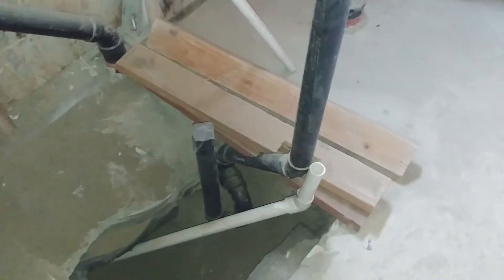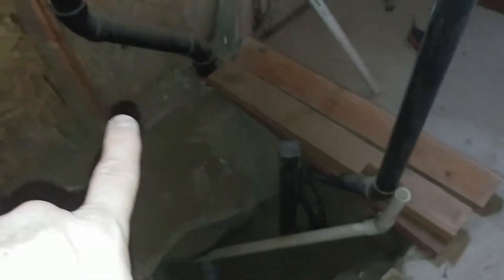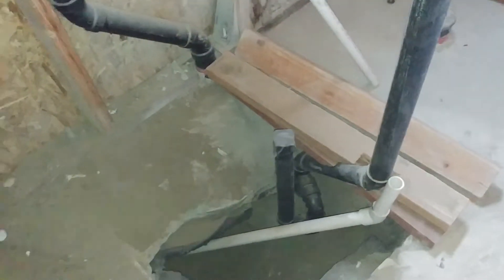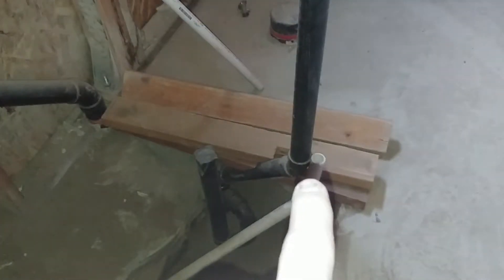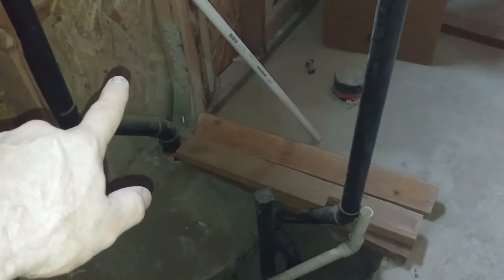In this area it does freeze just barely, so you kind of don't want to have the water running along the exterior wall — and that's something you're going to find in the northeast, midwest, and anywhere it gets cold. So what I want to do is take this PVC, thinking about cutting it right here, maybe having the PVC come up on this side and the exhaust on the other side. That would allow me to put a water spigot — a hose bib — right outside.